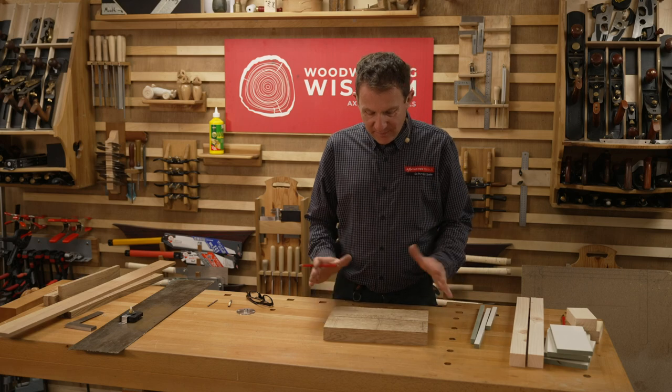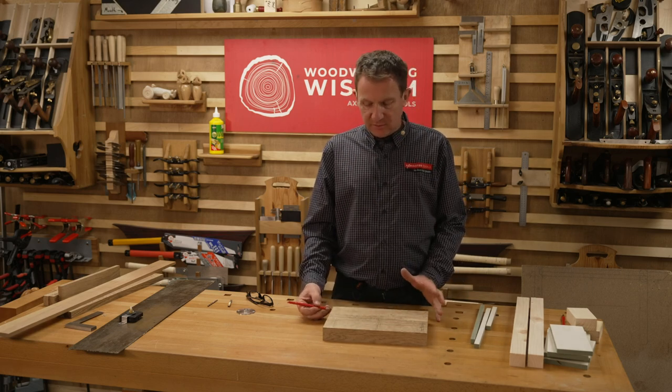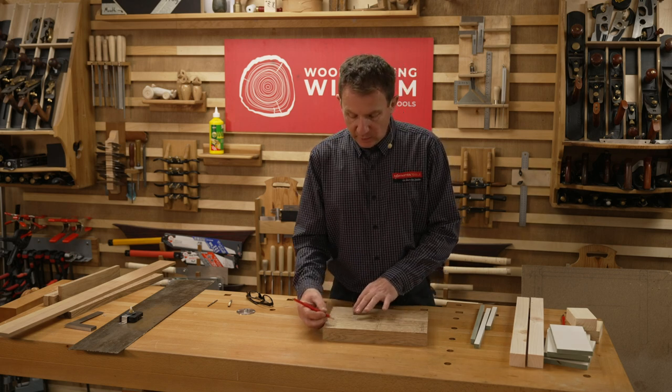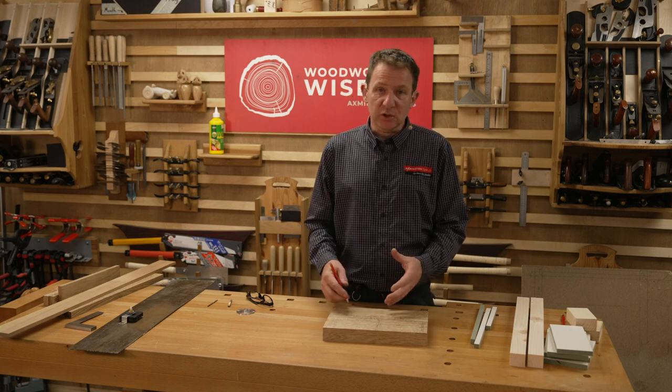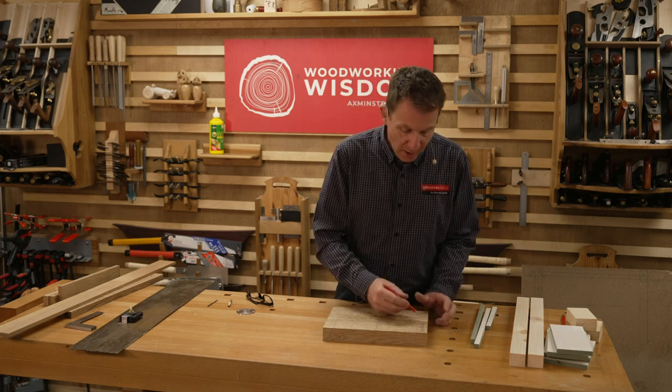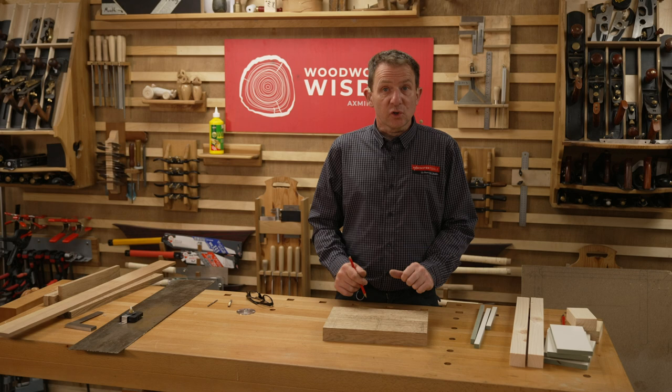All right, so having got our bits of oak, we've marked out those joints. Like I said, in reality I've marked them in pencil. It's hard work trying to cut into the oak, and if you make any mistakes, it's difficult to get rid of them. So pencil lines, as long as you've got a sharp pencil and an accurate square, are good to do, all right?